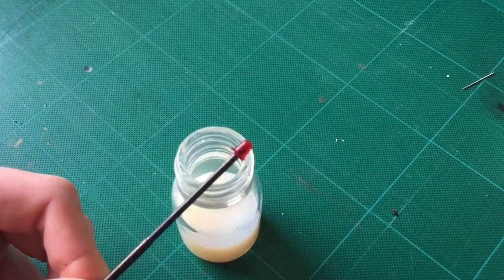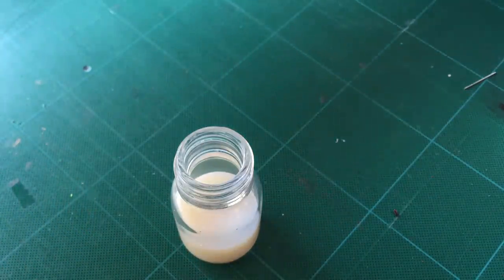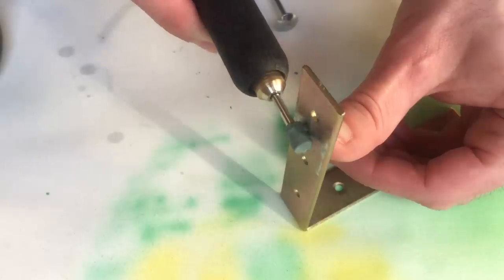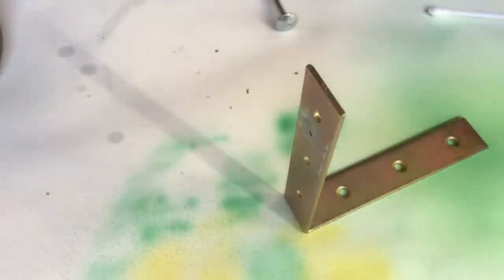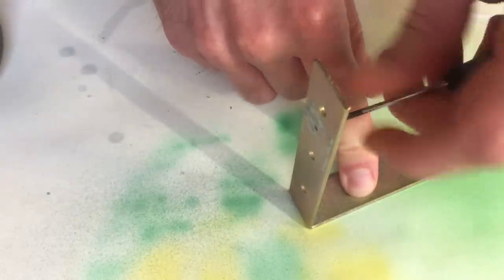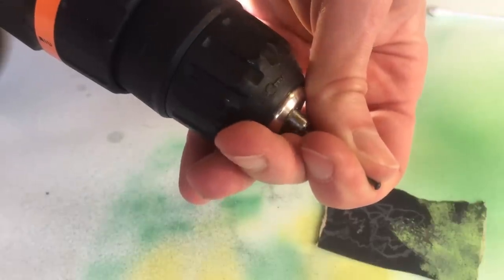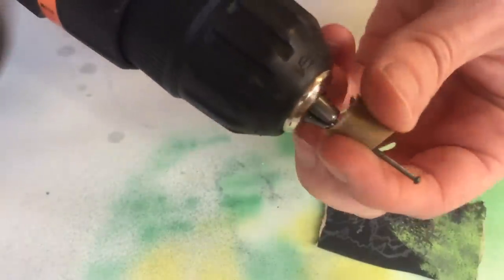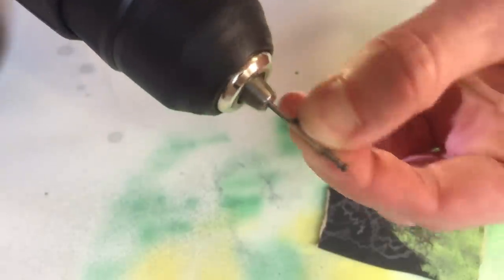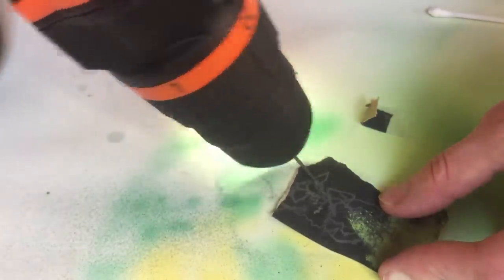To refurbish the light beacon, I've sanded it with some fine grit emery paper and submerged it in some floor polish. The faded red color goes away after the floor polish has done its work and it will look like new again. I prepare both screws that will go into the rivet posts — it looks like I've used the wrong tool as the screw eats away more of the tool's material than expected. Sometimes you learn things the hard way. I also clean up the axles with some emery paper, running them in my hand drill until they look nice and shiny again. If someone is interested in buying the art pieces I create on the emery paper while doing this, let me know — I'm up for any offers.